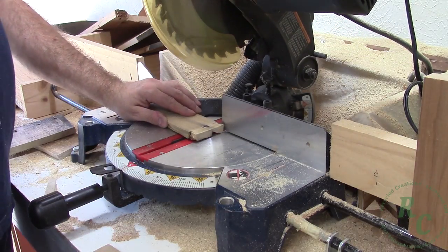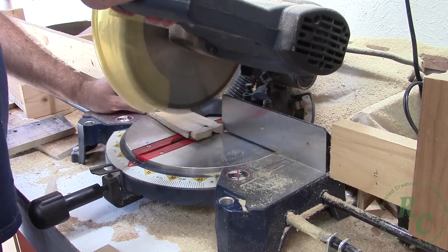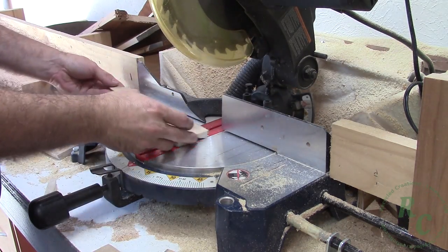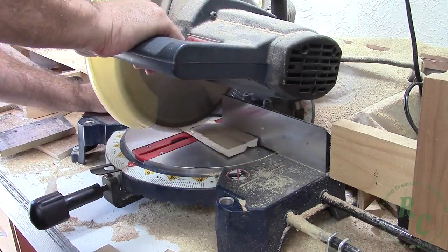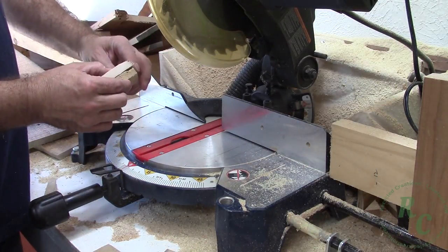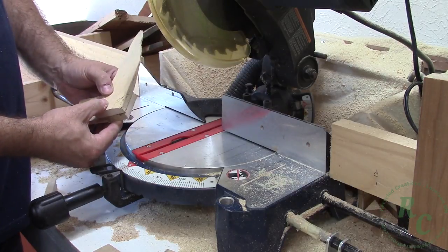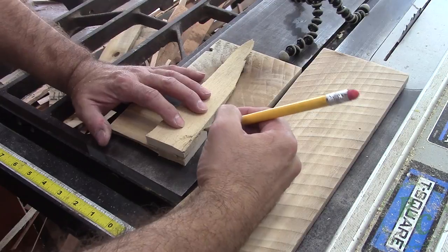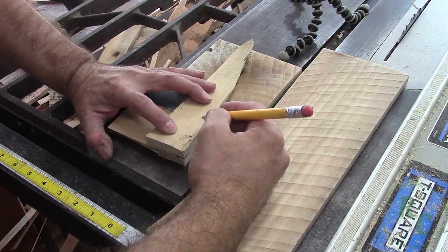This particular design is pretty rustic so I grabbed some pretty gnarly scraps to make the little bracket that holds up the shelf. I'm creating a sort of different joint that creates a 90-degree right-angle bracket, but it's a little more decorative and it produces a lot more glue surface.